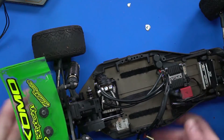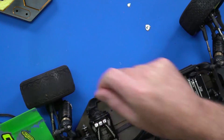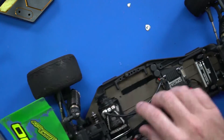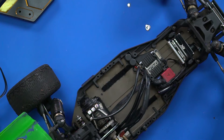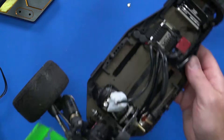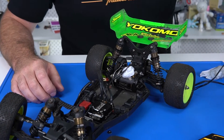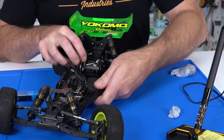The next thing I'm going to do is retin the wires, starting with my A wire. As a soldering helper, I often use a little bit of blue tack — really good so you can get the wire at the angle that you want. I always like to solder with the wire facing upward, because heat always travels upwards. Tin the soldering iron, tin the wire, get a nice circular blob on there without getting too much. And if your blue tack does melt, you just wipe it off.